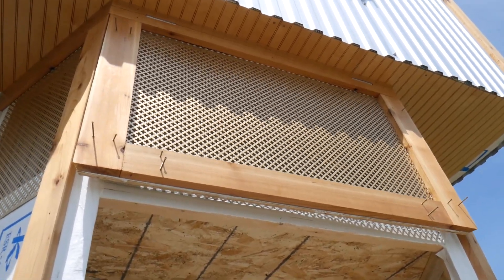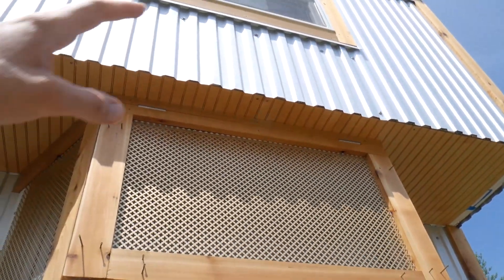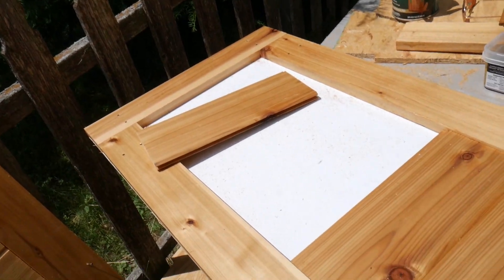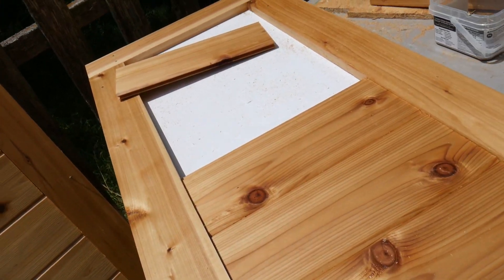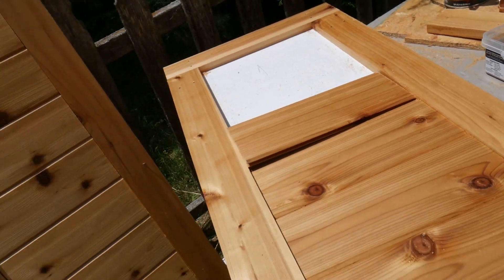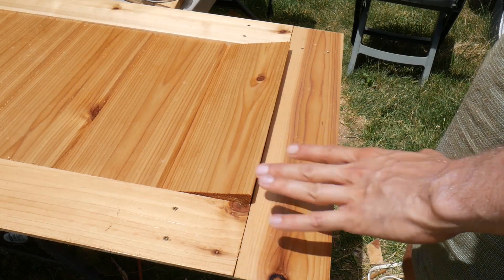Lindy and I got the little mesh door on — I just need to grind off some screws that are too long on the other side. The hinges were a little difficult and it doesn't close all the way without pushing, but it'll be latched so it's not the end of the world. For the lower compartment doors it's really simple: one-by-four cedar trim pieces framing it out like a window, with the top piece going the full length and the bottom piece shorter so water runs off. I'm doing six-inch tongue and groove pieces just like the siding. To make that corner work I ran the piece through the table saw at about a 30-degree angle. The last piece going in was cut at 15 degrees — I found that to be the perfect angle.